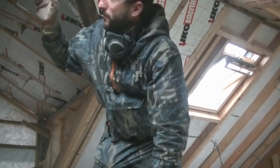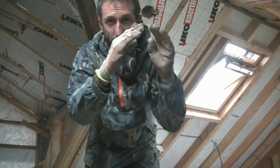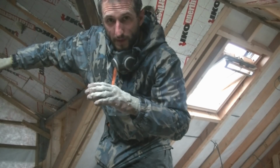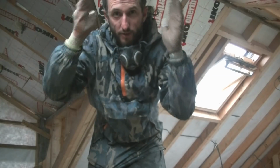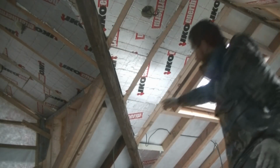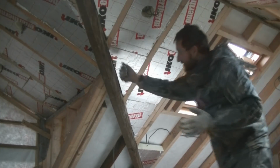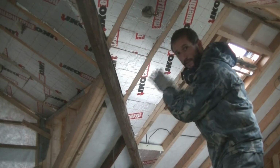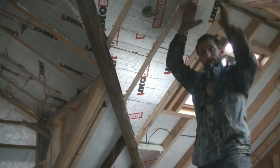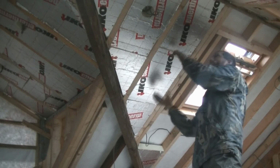Like I said, when we get up on the top here, on the ridge board, I've been trimming a shorter piece at the right angle so I can fit it up. I've been wedging the pieces down on the wall plates. Those pieces go in, then a third one in the middle. When I've been going on these diagonal cuts by here, I've been doing a bottom cut here, so I get that triangle, get that cut nicely, because this is at a funny angle, get the tapered angle in, fit it in, so it's all nice and snug. And I've been doing the ridge board again up here, fitting that into place, and then putting my middle one in. So I got 1 piece, 2 piece, 3 piece.